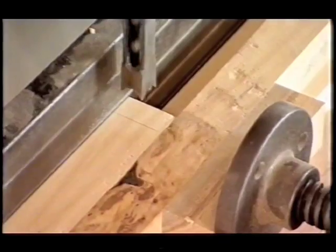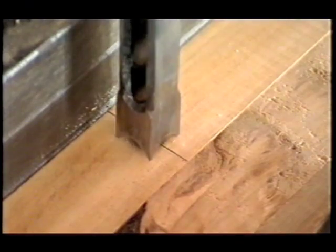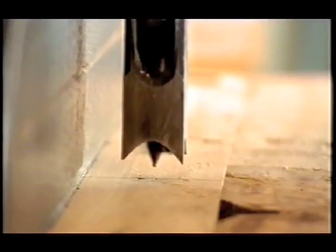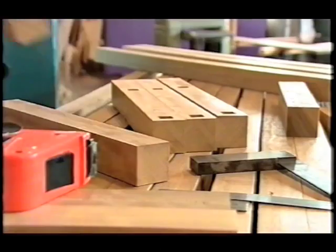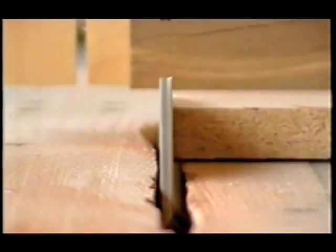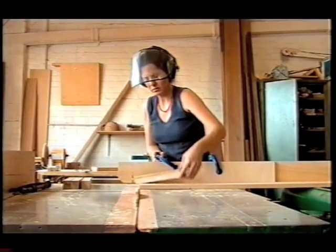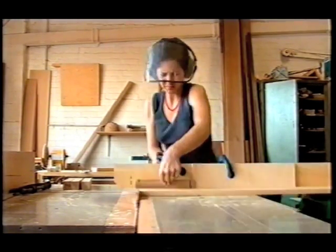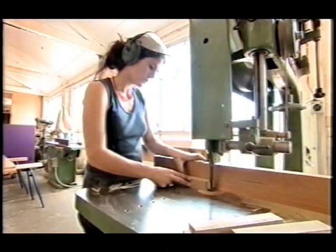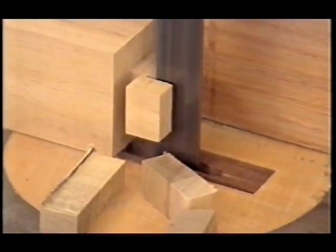It's a really good traditional joint. I will be using glue but that's the secondary thing — the main force of the joint is going to be the mortise and tenon. The mortise is the hole in one of the pieces of timber, made using a mortising bit on a drill press. The tenon is the tongue on the other piece of timber that fits into the mortise. You want to get a really nice clean shoulder on all four edges of the tenon, which is what I do on the table saw. If your piece of timber is not square it won't line up. You then take it to the band saw and cut the cheeks off, which will leave you with the tenon.